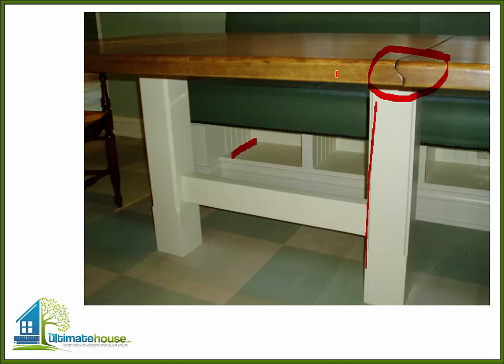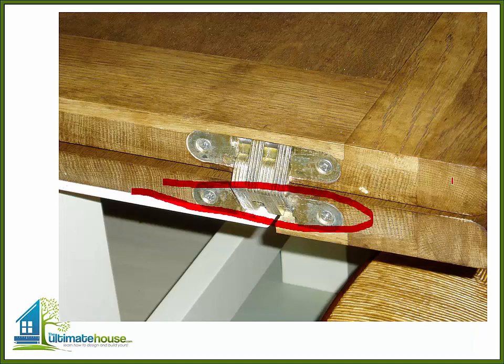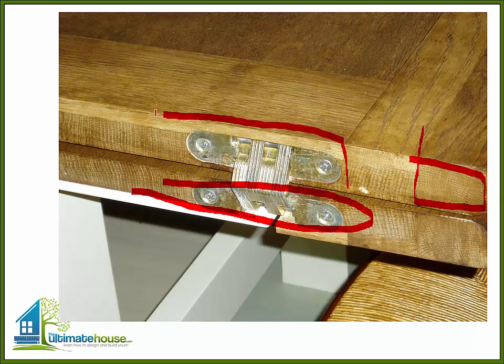You can see the oak table that we built on top with this interesting keyed scarf joint here, which allows the table to open and close. We used SOSS hinges — that's S-O-S-S — a concealed hinge. Because this is a big heavy oak table we had to use very large ones, which are unusual. You can see the detail here where the steel fits in and the wood fits in around it very nicely. Another shot of that hinge shows the antique oak, and how we laid up the oak, rounded the edge, used several different pieces to create a frame for the table.